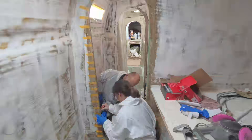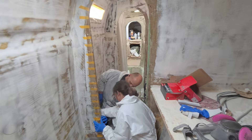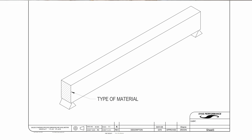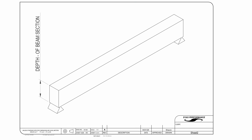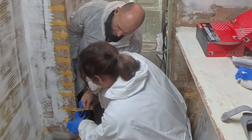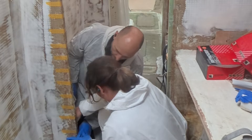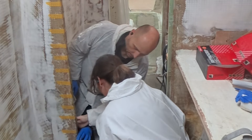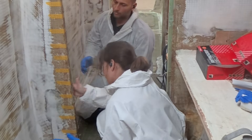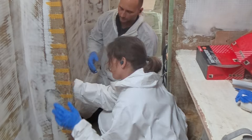When you're talking about beams there are three major inputs: one is the stiffness and strength of the material, the second is the depth of the beam, and the third is the length of the span. As one increases, the requirements for the others have to adjust so that the beam does its job.